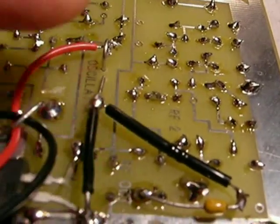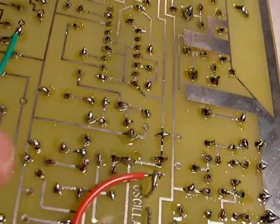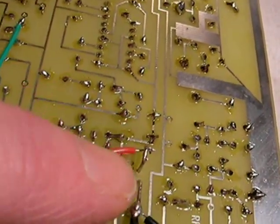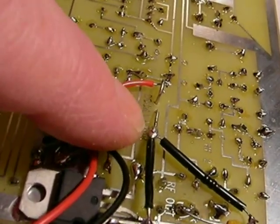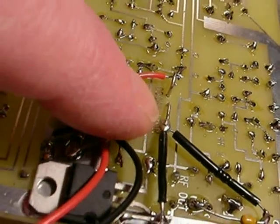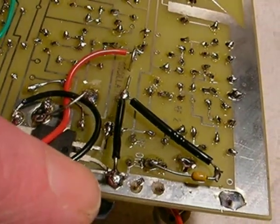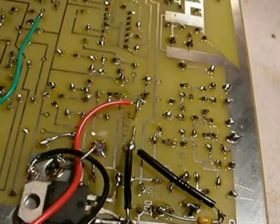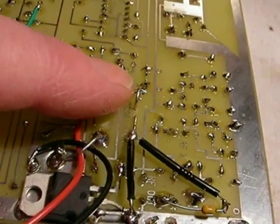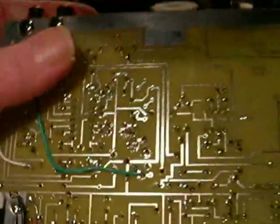Not here any longer. Make sure this is your 9 volts in right here — that goes through that 10 ohm resistor, out of the 10 ohm resistor to the plus of the filter capacitor, the 2200 microfarad filter, then out of that connection a straight wire over to the beginning of the regulator, and then there's your 56k resistor to the base. Make sure that your 9 volts feeds into that resistor right there, and your ground of course goes to the pad over here.